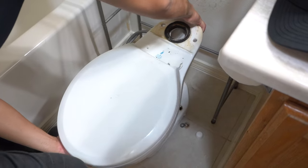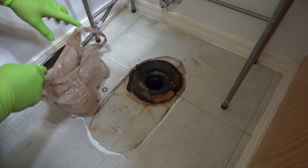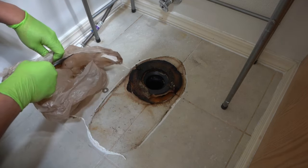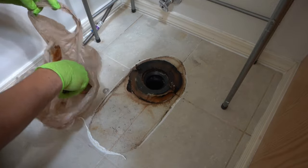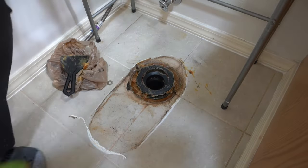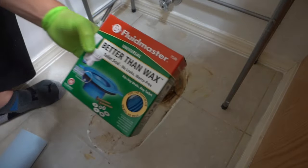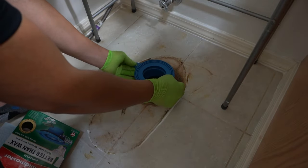After you take out the caulking and detach those two nuts on each side, you'll notice a little bit of gas smell, so just bear with it — you can cover the opening with a rag or tape it up. What I'm removing right here is the toilet wax seal attached to the toilet flange, which creates the seal between the bowl and your drainage. I don't like using wax because it takes a very long time to clean up and it's very messy. Take your time and remove as much wax as you can. I'll be showing you a better method — the Better Than Wax toilet seal — which makes future maintenance much easier.